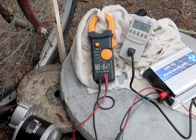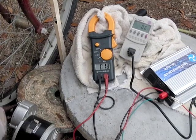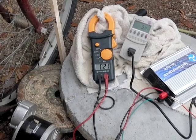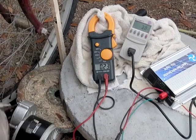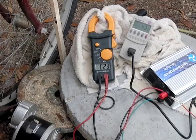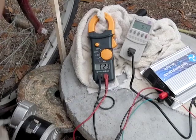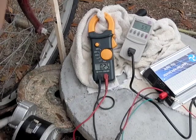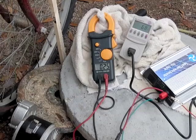You're going to see — I don't know if you can see the green light on the grid tie inverter, but those lights need to start moving. I'm below the voltage right now, so I'm going to pick it up a little bit. You can see that they started clicking. That is 30 watts that I'm putting back into our house's grid. I found that about 24 volts is an ideal rate to be at — if you go above it, it tends to spike. Now it's actually getting a lot harder to pedal. That's 65 watts — like a 65 watt light bulb — 70 watts.